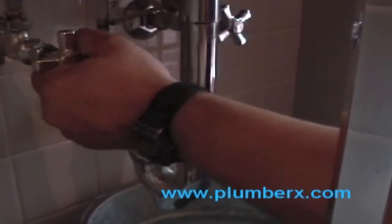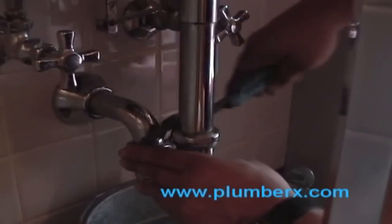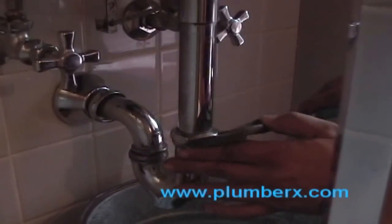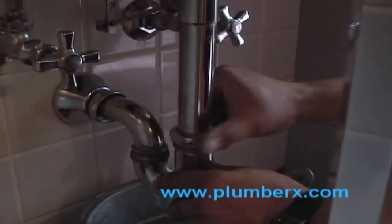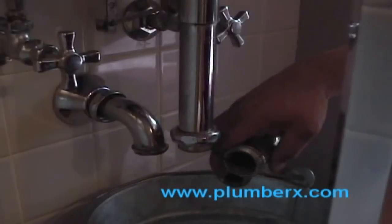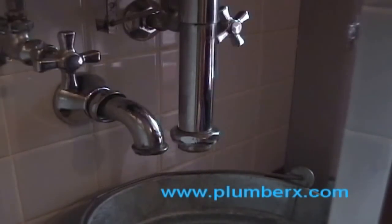And what we like to do is to get a small bucket to catch the water that's still trapped in the P-trap once we remove our P-trap, so we don't get any water on the floor. And we just take this apart with our channel lock pliers. And also, this is a good way to unstop a clogged sink, because sometimes the stoppage could be right there in the trap.